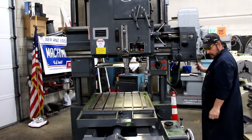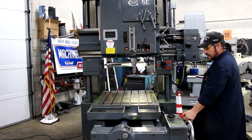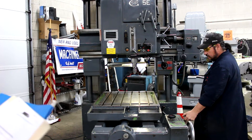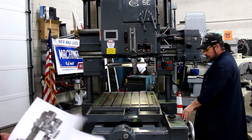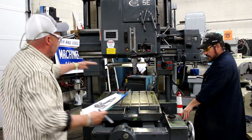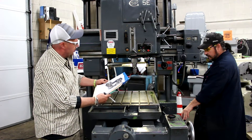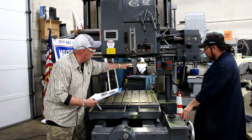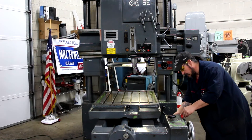This is a good specification to talk about. We have a minimum clearance of 7 and 7/8 inches, and a maximum of 37 and 7/8 inches underneath the spindle. We're running through the feeds — this machine has standard feeds on it.